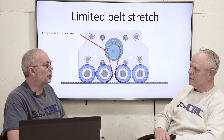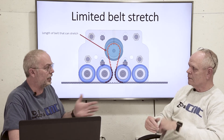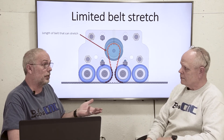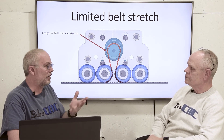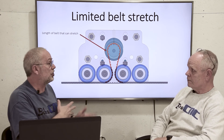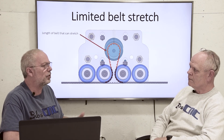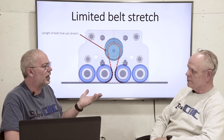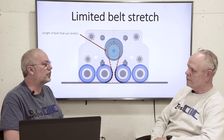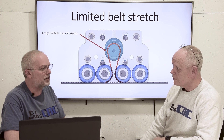The other nice thing is you can tune your acceleration. When you watch some of our videos of the KL series moving around, you'll see it zips pretty good for a large machine. Our E3 and E4 zip around pretty good, but they're light — so when you can be heavy and zip like this thing, that's impressive. The depth of cut has nothing to do with the Bell Everman — it's just that we have more powerful motors. On the KL7, we're cutting at 0.1 inches per pass with a 1/8-inch double flute straight flute bit at 150 inches a minute for production.